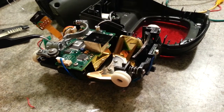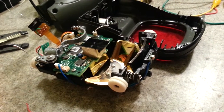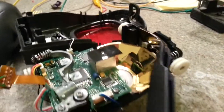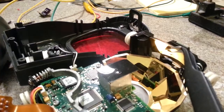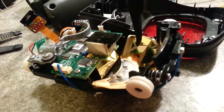So how it works is it's a single point source laser here which you can adjust the aim of using a couple different screws around here, which is why this fixture is so oddly shaped. This single point source then bounces off of this mirror here — as you can see there's a little flat section of it — and that actually bounces it down to the spinning set of mirrors down here.